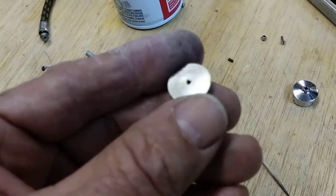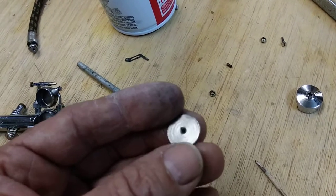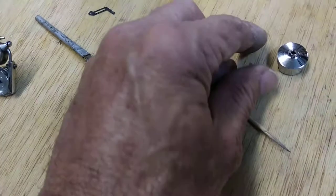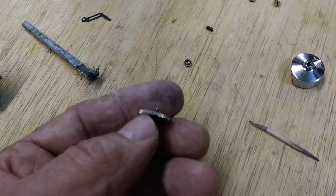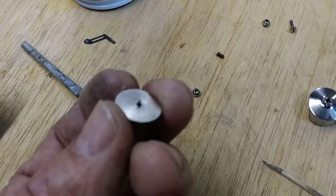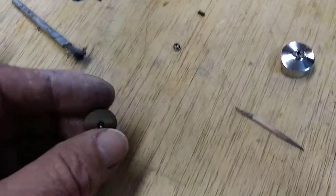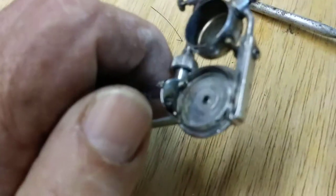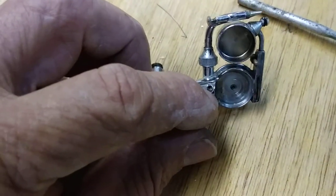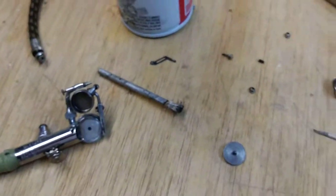I've taken and polished that little wheel up — it's a lot cleaner now. It was kind of black, just had a little patina on it. Paint doesn't get in any of this; it's all mixed externally over there by the needle. But I had a little bit of dried grease or something. These are extremely delicate, fine, tiny little intricate parts — like a watch. So there's the bottom of the disk, got that all cleaned and shined. There's the top with the cam. I did blast some carburetor cleaner through there and got some air to stream out of that hole, and also cleaned up all the gook out of the screw hole on the top where the adjustment screw goes. I'm going to polish that off, put some oil on that, and put that back together.